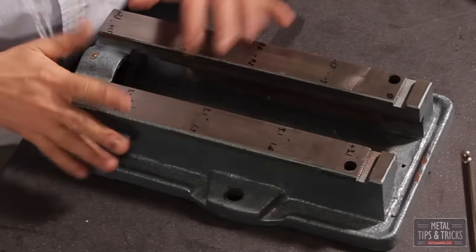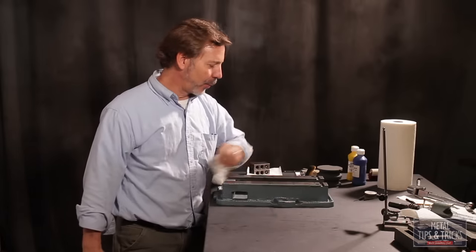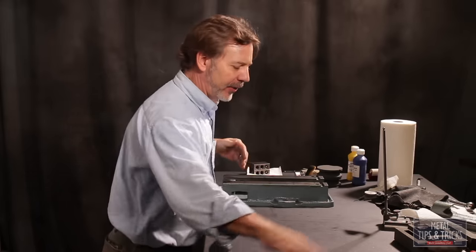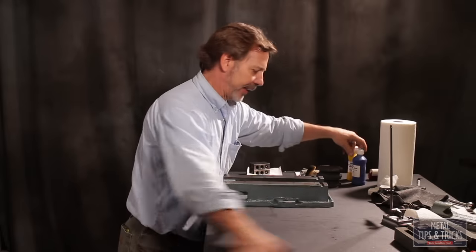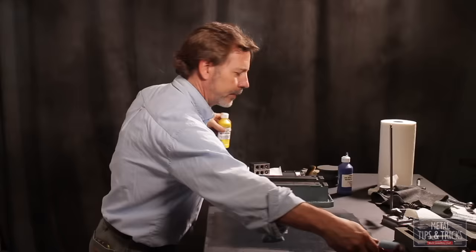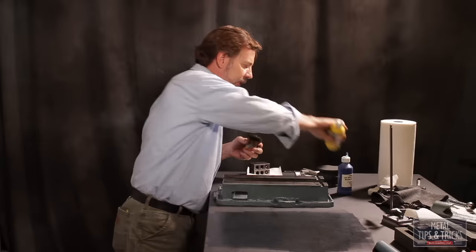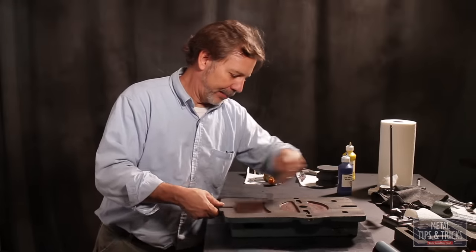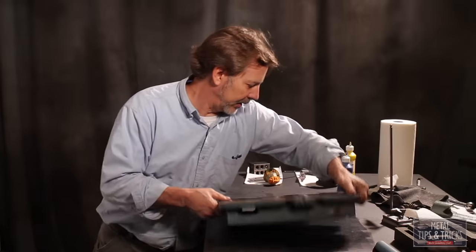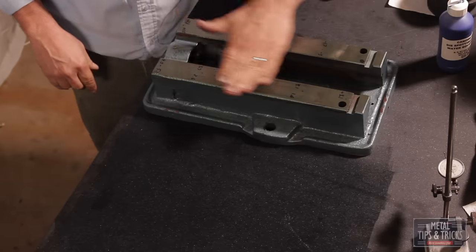We have mapped this out — we've got a lot of work ahead. We're going to ink this up as though we're going to scrape it in. I've got some challenges since the surface is a ground surface; we may not be able to ink it as well as I'd like. I'm going to put down a very thin layer of spotting dye — some call it inking, some call it spotting. Now we can see we've got quite a bit of rock, some high points. We've got a little blue here and there, so this thing is definitely dished out in the center.